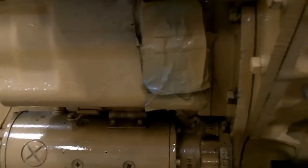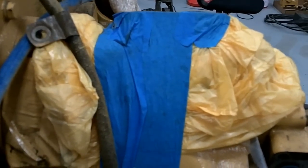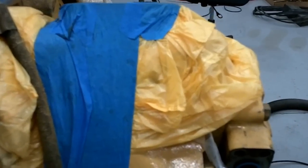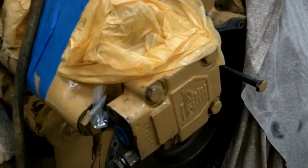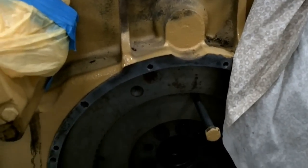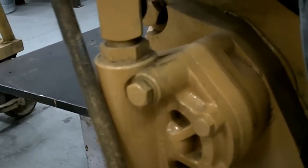This first pump you've got under here is the steering pump — you've got a large section and a small section. Then the compressor. These two big main pumps run on the same gear in here; there's another pump identical to the steering. The large section of this pump operates the lift cylinders and the bowl and the ejector control. The small section on the back runs your cushion hitch. Here's your flywheel, and the retarder goes in there. There's one more pump on the bottom — it does nothing but run the bell cylinder.